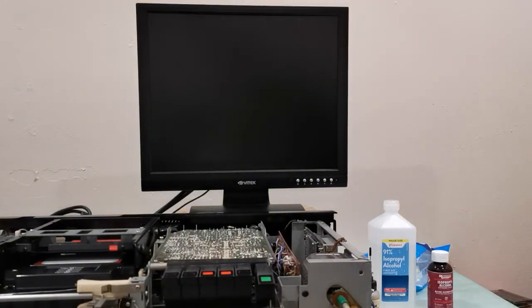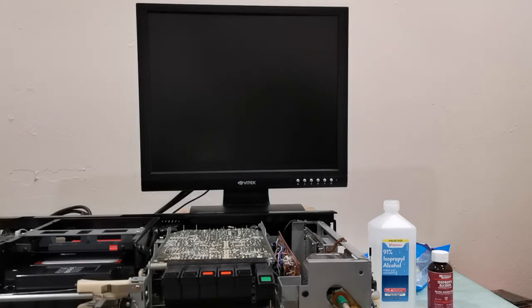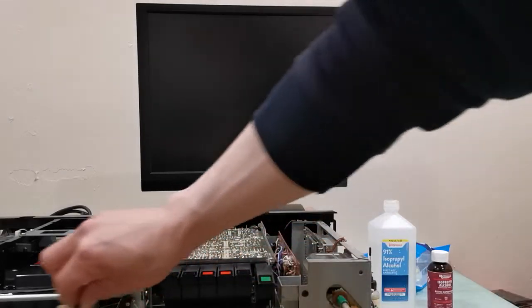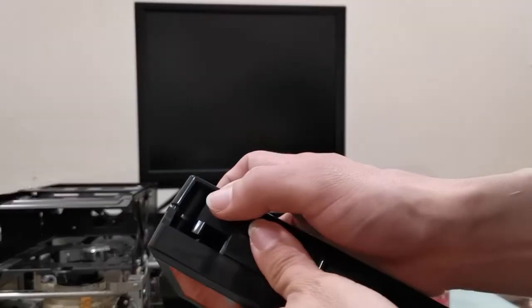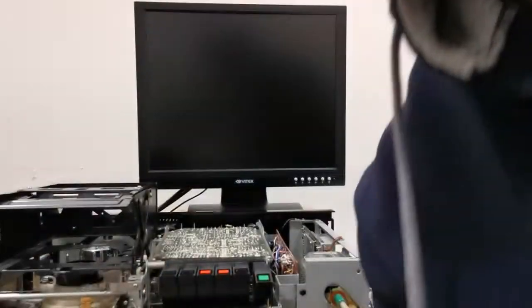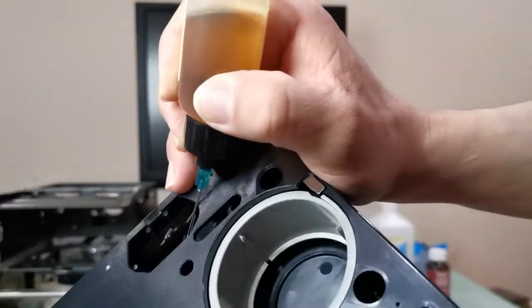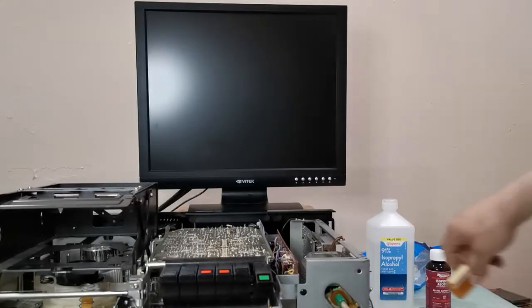I've been using this machine for about a year and a half. It does require a lot of maintenance — every two hours. As you noticed, you started seeing white artifacts, and that is in fact oxide. This format is an oxide-based format. That's not the recordable side — the recordable medium in here is in fact a brown color. The ribbon in there is a brownish color because it is an oxide-based formulation — quite an awful formulation.